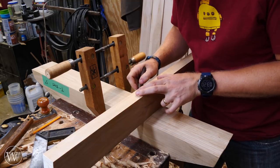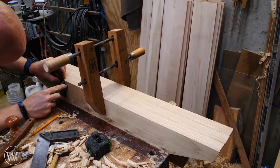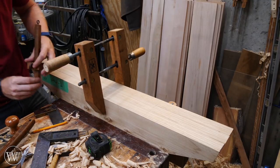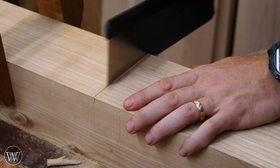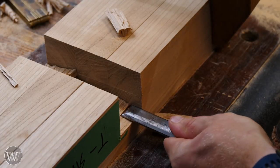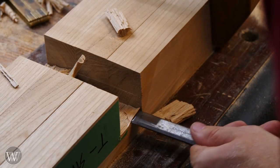For all three of these stretchers, I ended up clamping them all together just like before. Holding them all in place guarantees they're all the same distance apart. Then I can use another board to lay out the exact thickness of each joint to make sure they fit the board they need to go into. I'll use a straight-edge square to draw the lines down the surface, then grab a marking gauge. The marking gauge gives me the depth of the cut — on these, about two inches down, so they're about two-and-three-quarter inches wide by about two inches down. Then I come in with the saw and cut down either side — you may have seen this process before. Then I come back for my favorite part again and clean out the joint. Take your time, don't take off too big a piece, and leave a little work at the bottom, because you can always take off more during joinery, but adding it back on is not as easy — it's very difficult for the tree to grow back a ring or two to help you out.